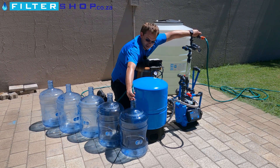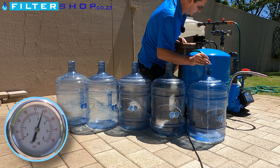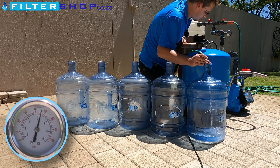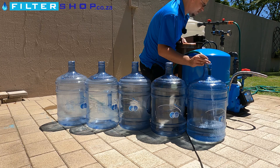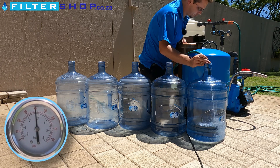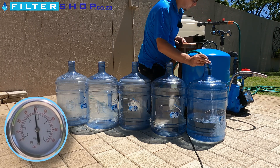If we open this hose pipe a bit, the tank is dropping slowly - we are at 3.3 bar, 3.2 bar, 3 bar pressure. We'd expect it to turn on at about 2.6. There we are at about 2.8, a little under half way of the bottle.